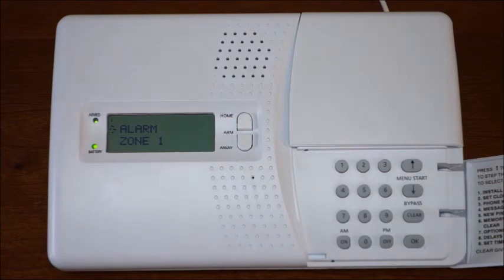The dialer is set to play that message three times automatically to ensure that whoever answers will hear it in its entirety. If someone is there to answer and picks up in the middle of the first playback, they will have two more chances to catch the full message. If no one is there to answer the call by the end of the second playback, then before the third playback of the recording starts, the console hangs up and dials the next number. If the alarm is tripped and no one answers or disarms the system, the siren will sound and the lights will flash for five minutes. The display will show the alarm zone, but the system remains armed and will trip again if another sensor zone is breached, repeating this cycle until the system is disarmed.